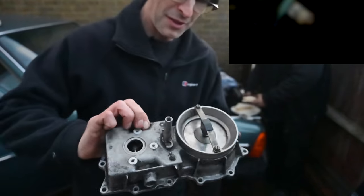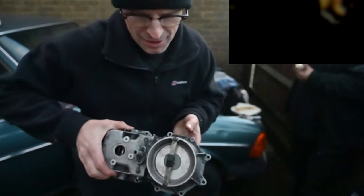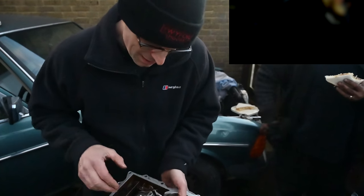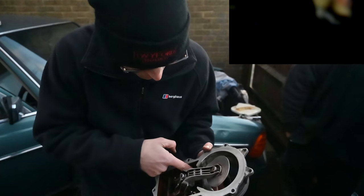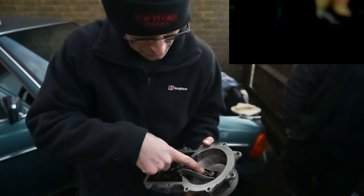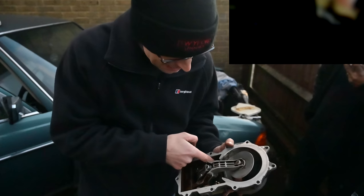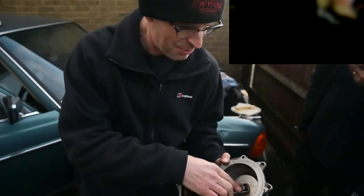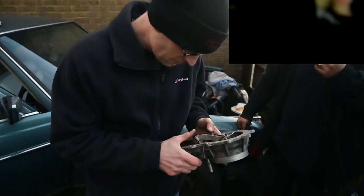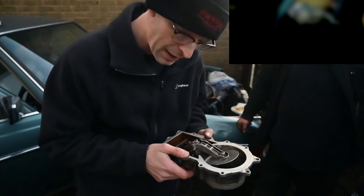The plate is meant to sit flush with the bevel where it stops - it comes to a point on the top and bottom and it's meant to sit flush. Before it kind of did, but now when we reassemble it, it sits slightly below. If we undo this screw and take out the rubber washer, the metal bar acts as a return spring where a pin on the bottom touches and it's fine. But the moment we tighten the screw up, it screws everything up and stops it going up as far as it should. There's a witness mark from however many years it's been in the car, but someone has previously taken this apart and horribly mangled it - so we may be copying an incorrect reassembly.